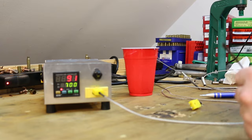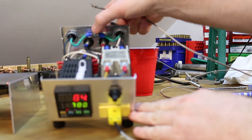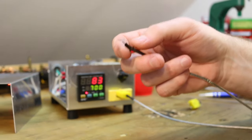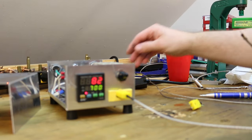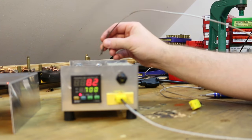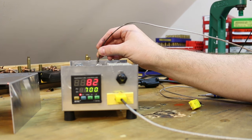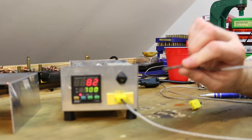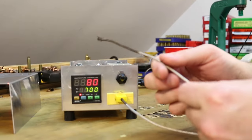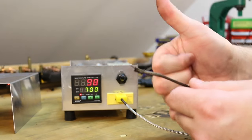Here's the other question: in my PID design the green wires are connected to the chassis. I'm curious — if you short this out or ground it, does that affect the reading? Right now we've got 82 degrees. Let's touch this to ground and see. It doesn't affect the reading. So being placed under that nut under the pot shouldn't make a difference. We only need the tip of the probe, and touching it to other metals doesn't seem to matter. It's all good.